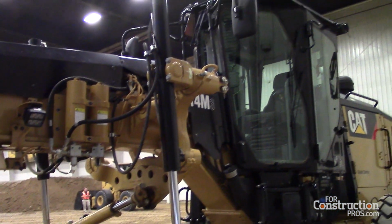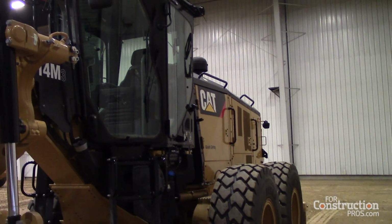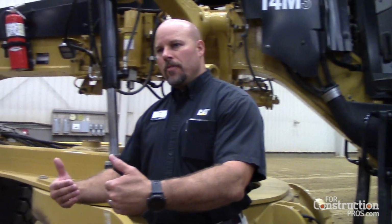When the motor grader is cutting, it's very stable. It doesn't bounce because there's cutting edge down pressure. When I go to do that feathering side of the application, that's when there's less down pressure on the cutting edge and the motor grader wants to start to hop. The motor grader starts to bounce. Most operators just let off the throttle. Slow the machine down, it kind of stabilizes, you get back into the throttle, it's going to happen again. It's going to happen again because you're traveling at that speed, you're in that gear, you're in that sweet spot where the bounce wants to occur.